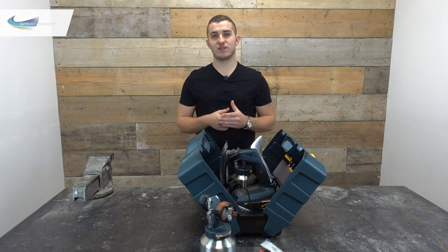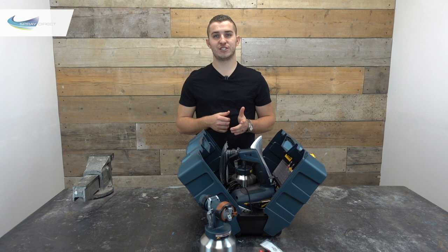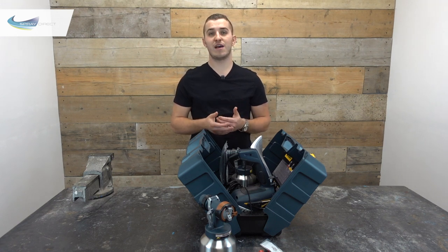XVLP is a similar concept to HVLP, but with that little bit more oomph behind it. So HVLP stands for high volume, low pressure. This refers to the high volume of air but at a low pressure, so we aren't creating as much overspray as we would with an airless system. XVLP stands for extra volume low pressure, so we're still operating at well below 10 psi, but with a little bit more air volume to atomize our material a little bit more, which gives us a really nice finish and very minimal overspray and paint wastage.